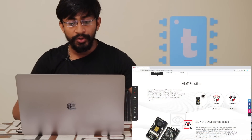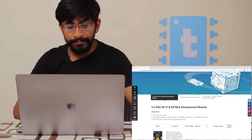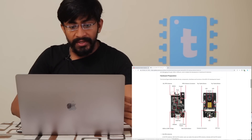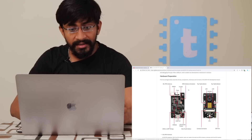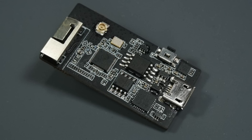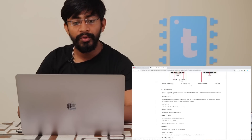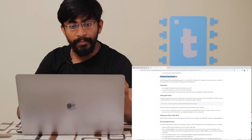Moving ahead, let's click on the hardware section of the website to see if we missed anything. Here is a properly labeled hardware diagram of the ESP-EYE. One thing we missed is the IPex connector — in earlier beta versions they were providing this antenna connector to attach an external antenna in case you need to increase the range of the ESP32 chip. A documentation link will be in the description.